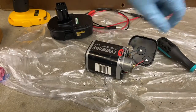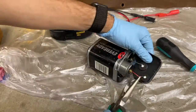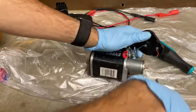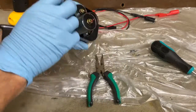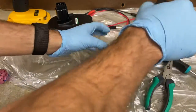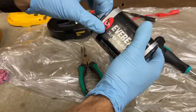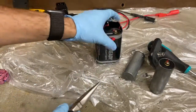This is a six-volt battery, so it has four 1.5-volt cells inside. I'm going to cut this open — be careful because if it's still charged you can create shorts and you don't want that. The bottom is also soldered but I think I can pull it. Let me cut these wires — there, got that one, and let's cut this one. Two cells out — I need two of those; you can save the other two for friends.